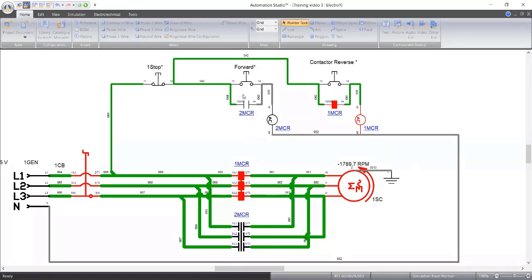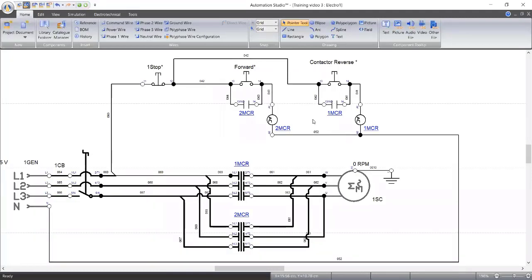You can see. So now we don't want the situation where we can press the two together. Bam, and our breaker trips. So all we need to do is to use another auxiliary contact of the contactor, a normally closed contact this time around for the two. That means contactor one will not start if contactor two is running. Contactor two will not start if contactor one is running. So we need auxiliary contact, just as you said. But this one won't stop it for us. It will only prevent us from starting. So let's do it.